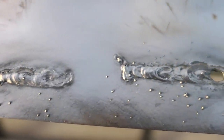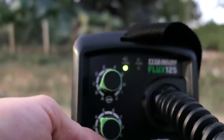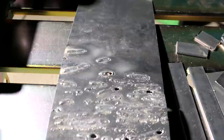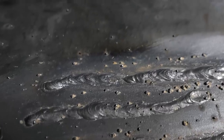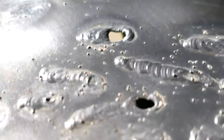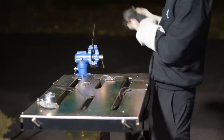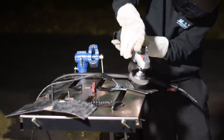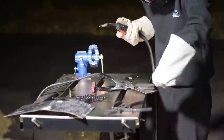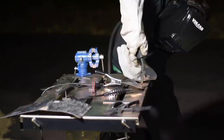The second bead I burned a hole through, but that's what practice is for. After much more practice experimenting with the dials and how I move the gun, I made many holes but learned I need to move a bit faster and figured out how far I can go without melting through. Next I used a cut off wheel on my angle grinder to cut two pieces and welded them back together as a butt joint, which is basically how I'll be welding the crack on my bike. I'll do a little at a time — it's good habit to clean the slag and clip the end of the wire after each weld, since the wire can ball up and cause issues with starting an arc.